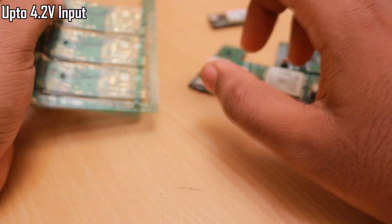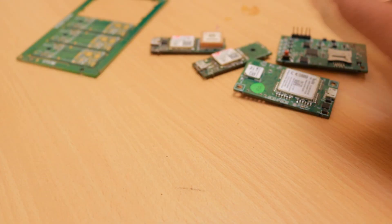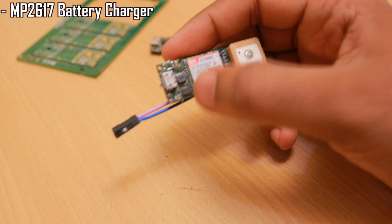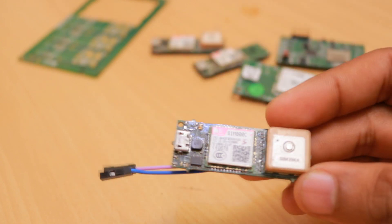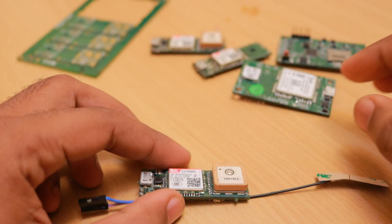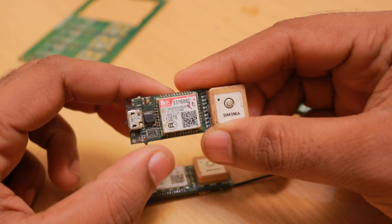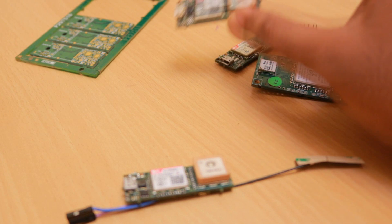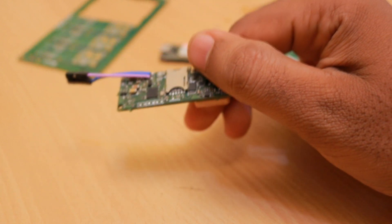Those are the reasons we discarded this chip and used the monolithic part in my design. I switched to the MP2617 battery charger. This battery charger can take up to 12V inputs and gives a regulated 4.2 volts or 4 volts to the other circuitry on the board. Even though it's operating at 12 volts it doesn't get hot. The good thing about this chip is it costs much less and requires fewer supporting components. As you can see in the footprint below, there is no heat sink for this — the chip is very efficient, it doesn't consume much power, and even though it's delivering 2 amps of current to the GSM module the pulse currents still don't cause it to get hot.